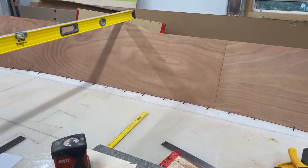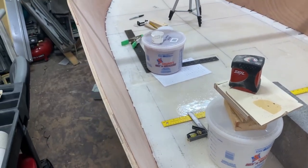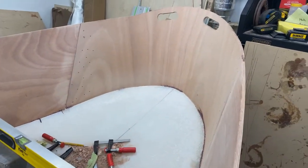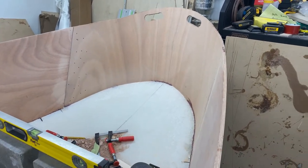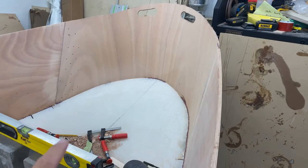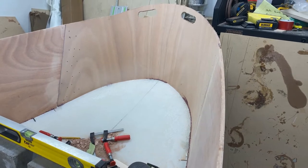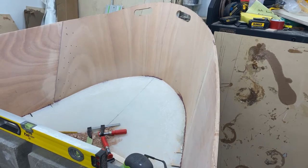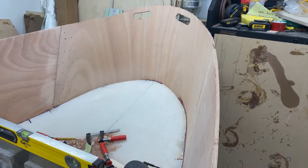It's been a couple days since I did the tack fillets. I ended up removing some of the zip ties and bailing wire on this side, but then I realized I should probably put a coat of epoxy on the transom before I do the final filleting, just to seal that wood. Even though it will get sealed by the epoxy in the fillet, I feel more comfortable sealing it with just raw epoxy before doing the filleting work.